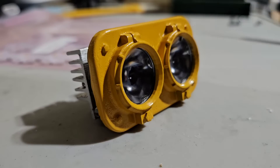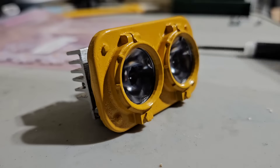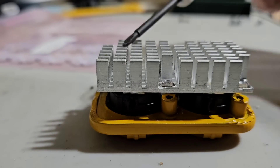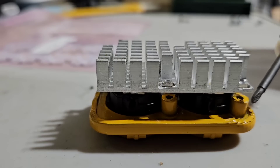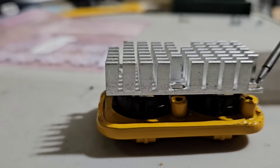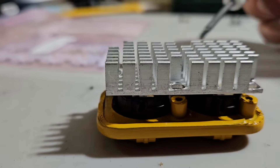The reason I started making these is because I wanted to bring more of my processes in-house. With the 3D printer, I could get a more consistent headlight bezel — something that fit the heat sink a little better, because the brass ones I was using didn't quite fit this heat sink. The bosses on the ends were just a little too far out, about 30 thousandths of an inch off each end longer.